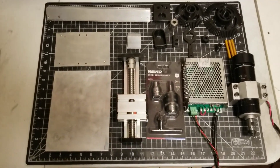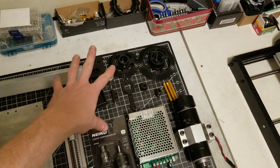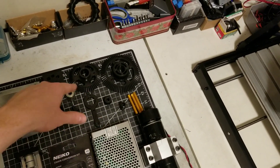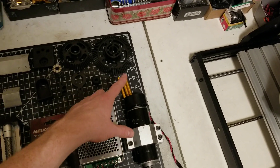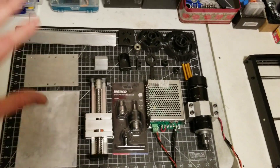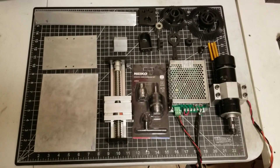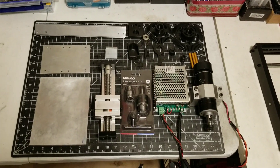All right boys, that's pretty much it. Prints are fresh off the printer — these are going to make up the crank system that actually drives the motor up and down on the Z-axis. We've got a couple of skateboard bearings, a lot of 3D-printed gears and parts, and then a couple of aluminum rod standoffs. The aluminum parts are all drilled, tapped, and ready to go. And as always, we're only using metric hardware — M4, baby, let's go. I think I'm going to hit you with that build montage.